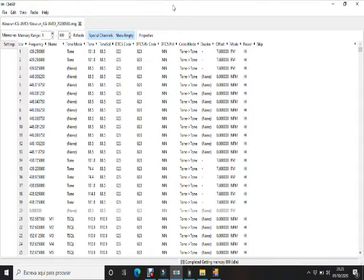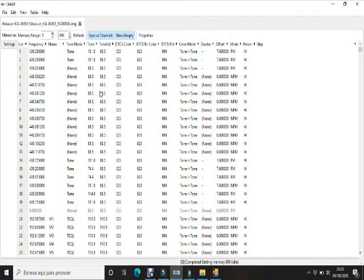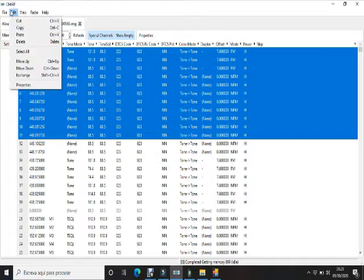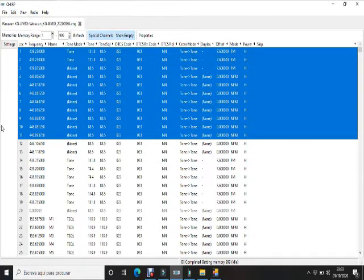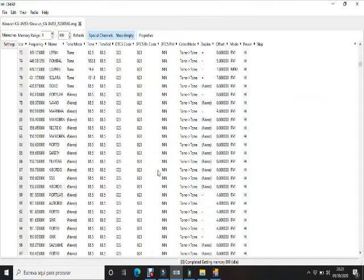If everything is going okay with the radio, if the GPS is on or is functioning, what you can do is read your radio with Chirp. You just go radio, download from radio, and you are going to receive all the frequencies that are programmed, usually none, or maybe some factory frequencies. Then you can copy paste from your image file. You just select whatever you want, and you can copy them to the file that you're going to upload to the radio.